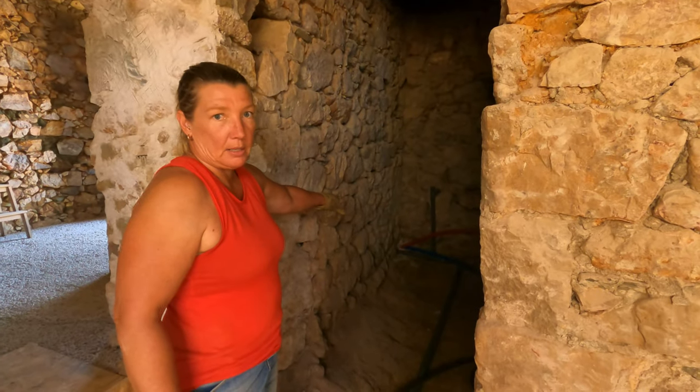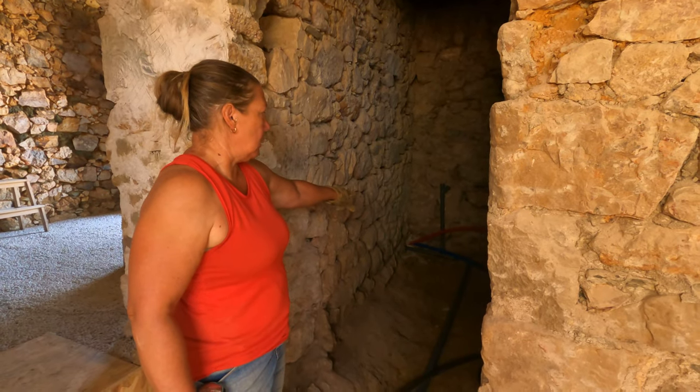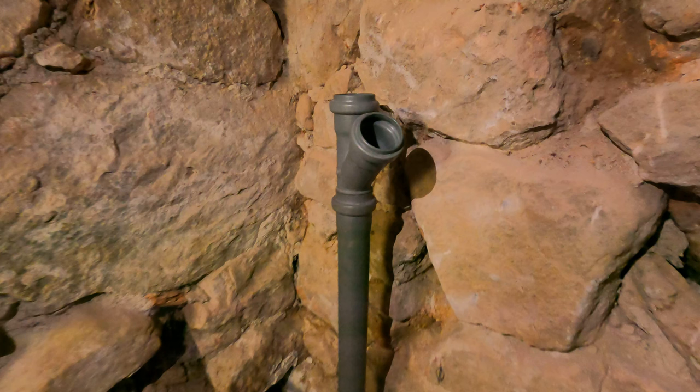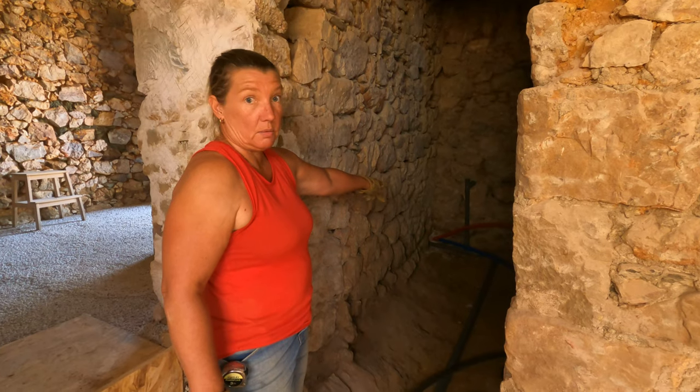We had the pipe coming out of the stone wall. That's the one that we had to replace. And that's a 40 mil pipe. The vertical piece there is also a 40 mil pipe, which will go to a sink unit. The second part of the Y there is an access point. So if we ever need to stick something down, if there is a blockage, we can. At that point where they come together, it goes into 50.